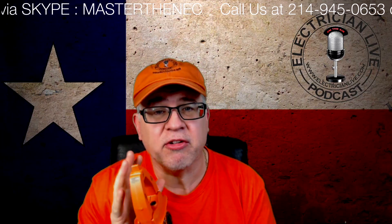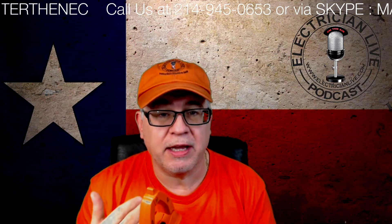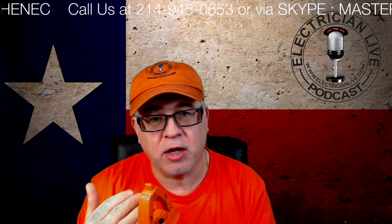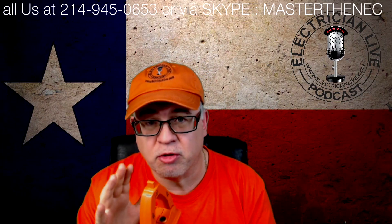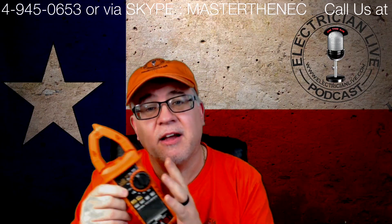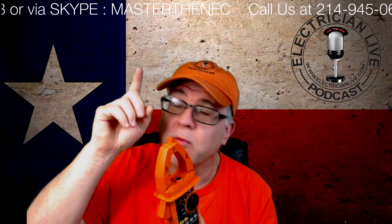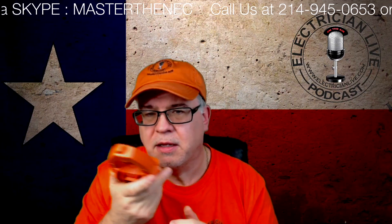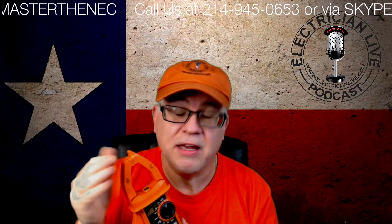I'm going to do a demonstration right here, and hopefully that'll come up on the camera. I have found out that with this unit the sensitivity is not overly sensitive where it picks up stray voltage that could cause it to act funky — it literally reacts to the voltage. I am actually able to trace a circuit in the wall, and that's important when you're trying to see which way a circuit goes. I'm going to turn it to the non-contact mode and prove it to you.